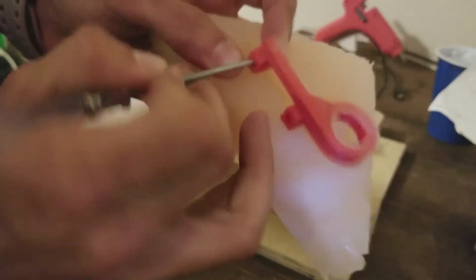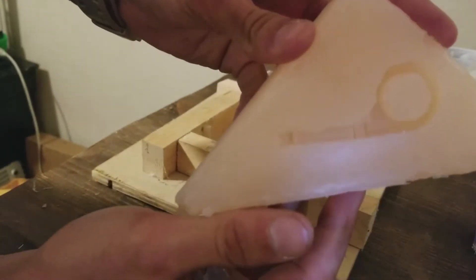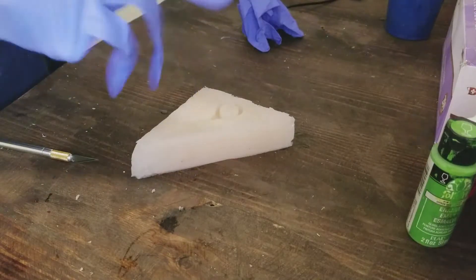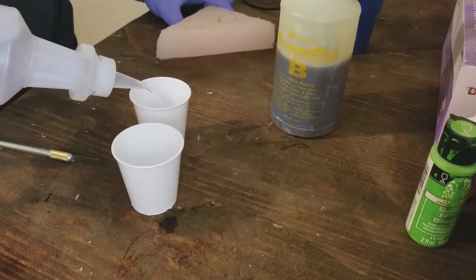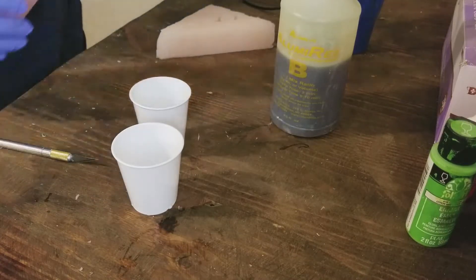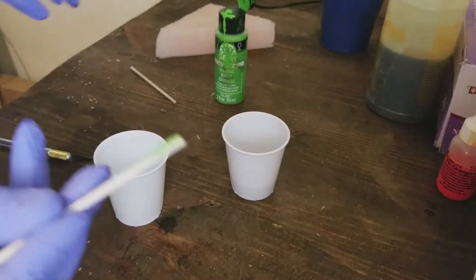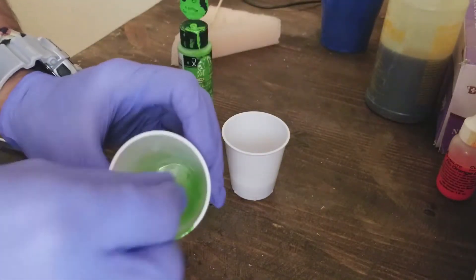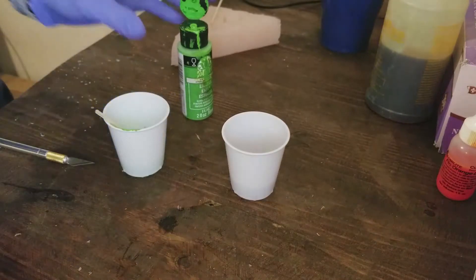A little screwdriver helps push those little silicone screw holes back in place. Now I've got the perfect size cavity to pour in some resin — in my case I'm using Alumilite. Same thing here, it's equal parts. I tried adding some color, but it turns out that water-based paint doesn't mix with the Alumilite at all — it just leaves chunks and separates out over time. I was just trying to match the colors I've used for other modifications on my 3D printer.